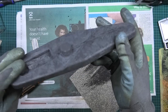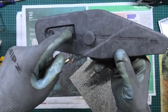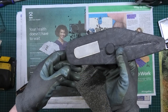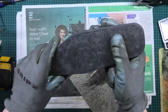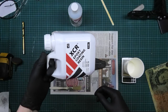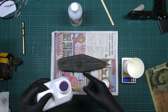I've got it to a state where it's not looking too bad. Obviously I've got the seam in the middle which I've still got to fill. The torque arm is going to fit there. I'll give it a resin coat and everything will be perfect. I'm going to do this in XCR epoxy coating resin - ten grams of resin and 4.1 grams of hardener.